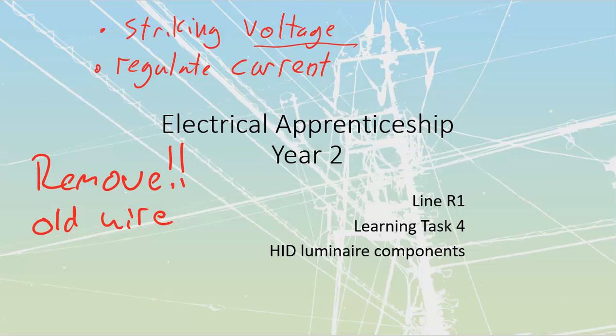For fluorescents, for HIDs, but for any type of lighting, particularly high frequency styles of lighting, we're going to talk about some induction lighting in a second, but my electronic fluorescent ballasts are operating up in the 20,000 hertz range, super high frequency. These HIDs are moving towards having some electronic ballast inside of them. LEDs are oftentimes going to be operating at fairly high frequencies as well, so that we can eliminate the amount of flicker that I would have out of them.